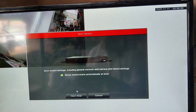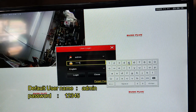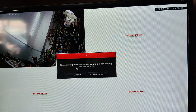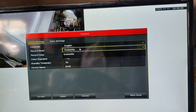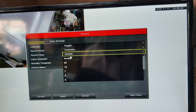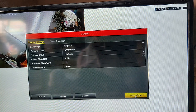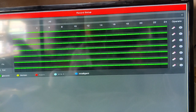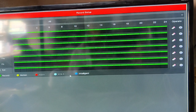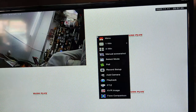Provide power to the DVR and switch it on. Connect the DVR output to an HDMI TV, then open the initial screen. The default username is admin and the default password is 12345. You can modify the password if you want. In the initial device settings, set the record mode to overwrite so that when the hard disk is full it will overwrite automatically. Click Apply. Enable DHCP for network connections, then click Next. The next screen shows record, motion, alarm and other settings — leave it in record mode for now.